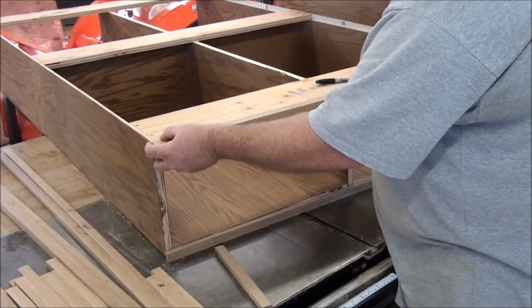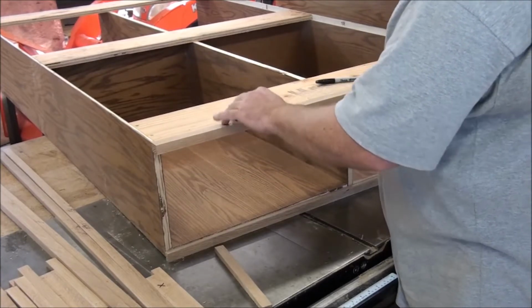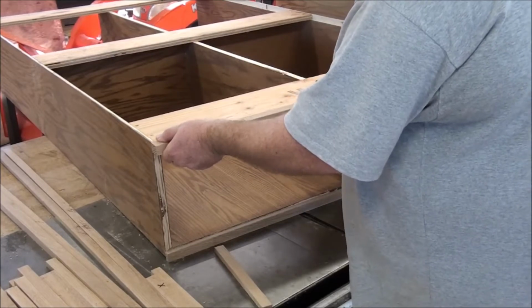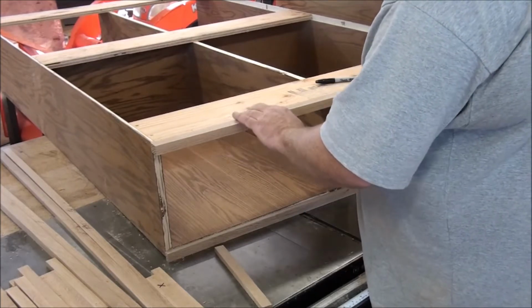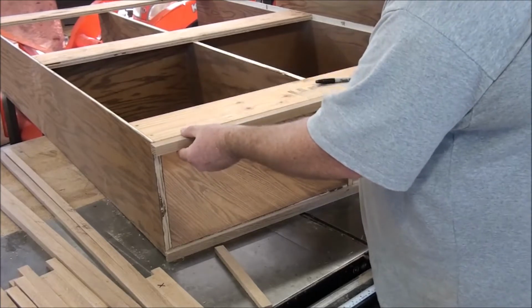The top rail is 1 inch, because that 1 inch is required to make the bed 76 inches wide. That again should be as flush as possible. It's not going to be something you see or feel until you're making the bed. This will all be sanded real nice because you're going to be tucking your sheets in under here.